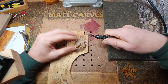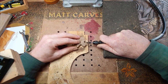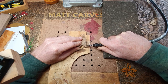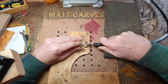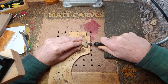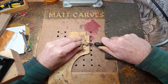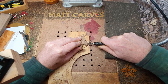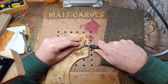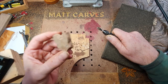You can see in the higher-up view I've got a sponge under my Dremel hand and I sort of press down on that, so there's not a lot of movement in the actual Dremel. If I was to lose control, I've got my hand on the table so it's not going to shoot off too much — you've got more power in your hand that way. It doesn't work for all carvings, but for a carving like this it's really good. I also find that with the sponge, when I'm carving a long time, I put it under my elbow just to make it a little bit more comfortable. When you're carving eight hours a day, you need to look after yourself.